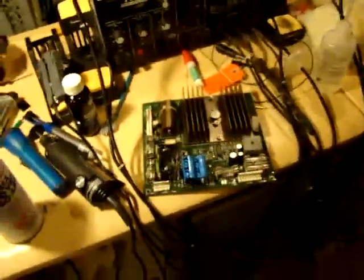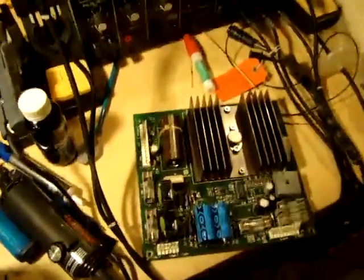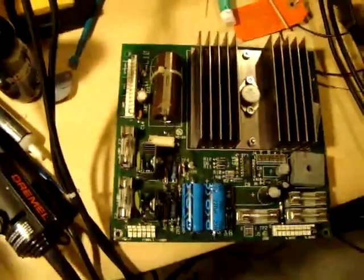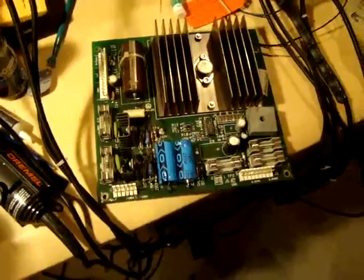Anyways, here's a dead transformer. Goodbye. It's out of Hyperball. It's being fixed. So what I've got basically right now is a situation where the 5-volt supply on this thing is down to 3.29 volts when I start up. And that was a situation where I measured off TP1 here and found that this is basically the reason why the game boots slowly.